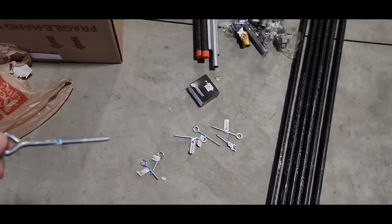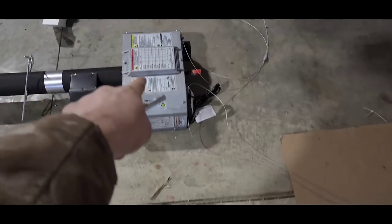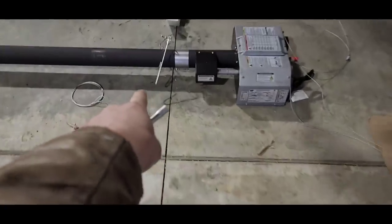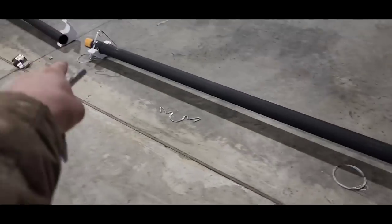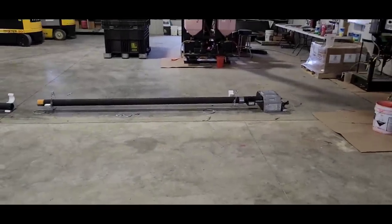I got our hooks. I actually got two different lengths, partially because they didn't have enough of one length and partially because I might be able to use two different lengths due to the way those roof purlins overlap each other — the wood boards and stuff. So we need to get the main lift and go up there and put some of these eye bolts in. Our heater is going to hang right underneath this first truss, but I need to be able to open the top compartment and sides on it, so I'm going to come back just to this side of it a little bit. We'll get eye bolts in there for the two on the heater, and then there's another one that's a little flexible in where it can be. We'll measure and put one in for the other end, and then that piece can go up and we can hang it.